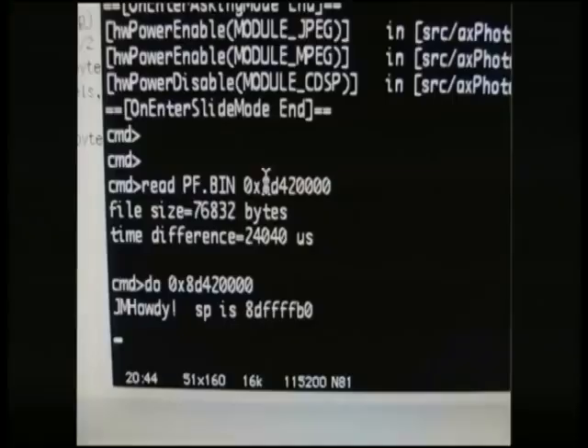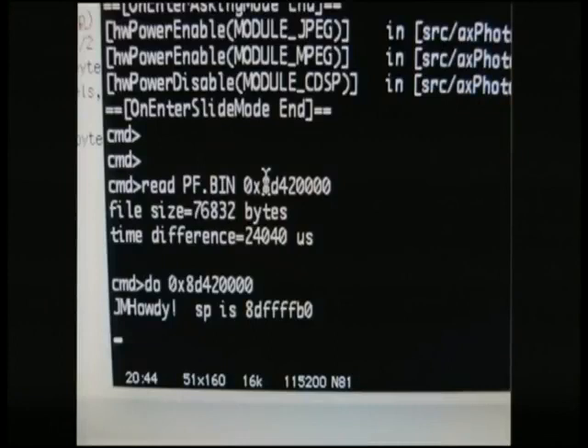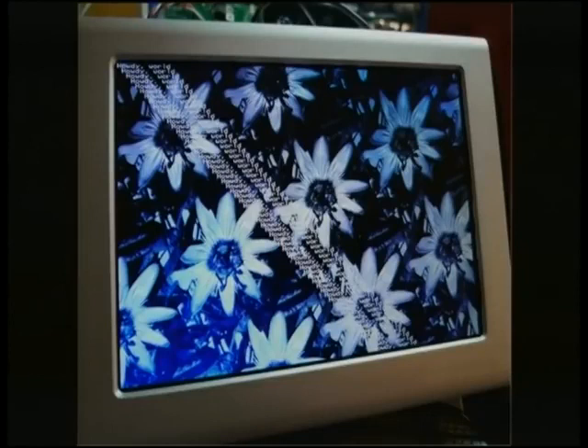As an artistic result, I got my hello-world running - currently it's doing a rot-zoom 90s demo effect on the screen. The frame buffer turned out to be a YUV buffer, not RGB, which makes sense given the digital camera origin. All the motion is on the luminance channel, while a separate chrominance channel adds the blue tinge. It's not very useful - it just sits there and twirls - but it could be a display for a NAS or other things with a bit of imagination.